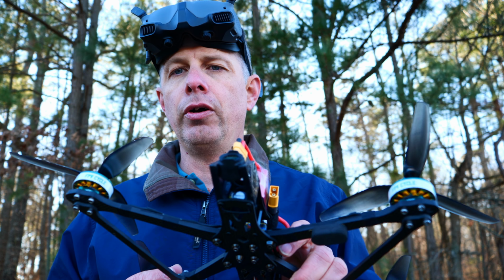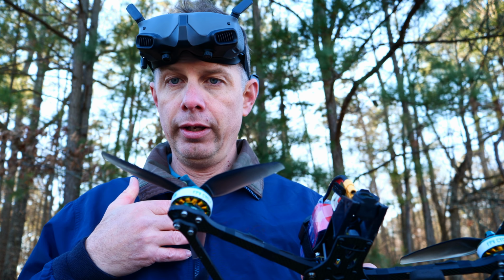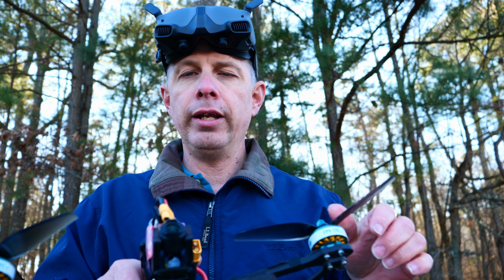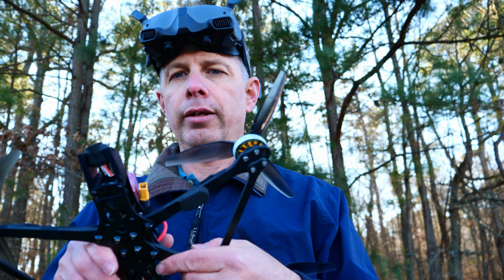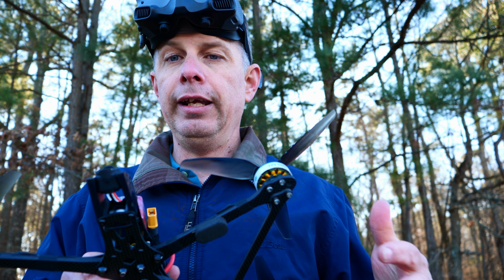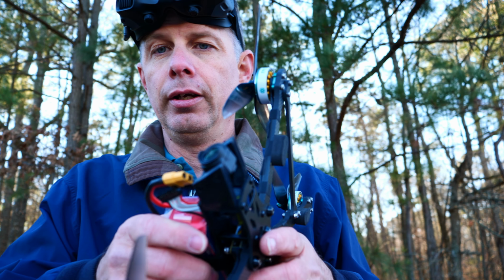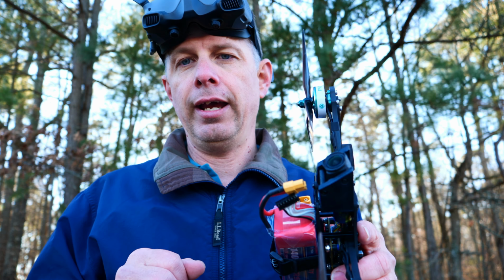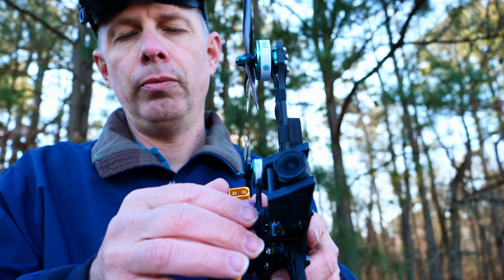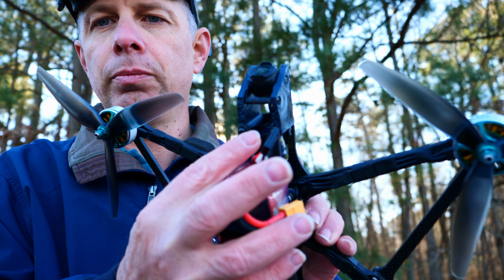An additional note that I am going to include in here is the fact that, as of the publishing of this video, if you are running the O3 Air Unit on here and you expect to have your props out of view, that's not going to happen. In fact, you won't even be able to install your camera in this frame as it stands today, because the frame will not allow your camera to be mounted behind these standoffs here. It's just simply too wide.